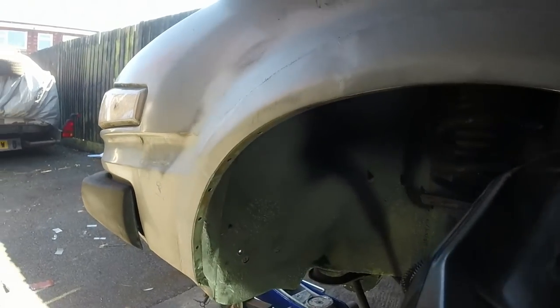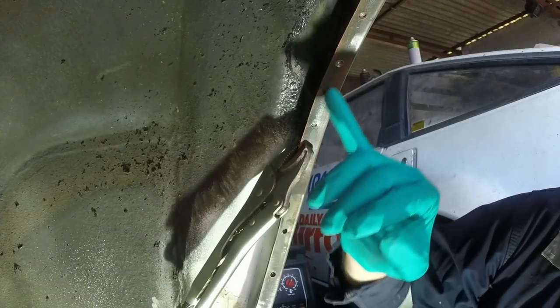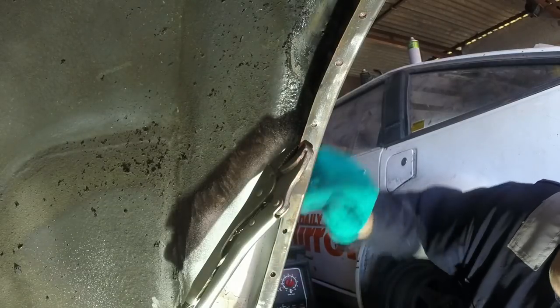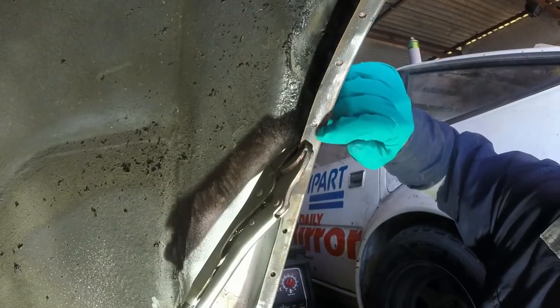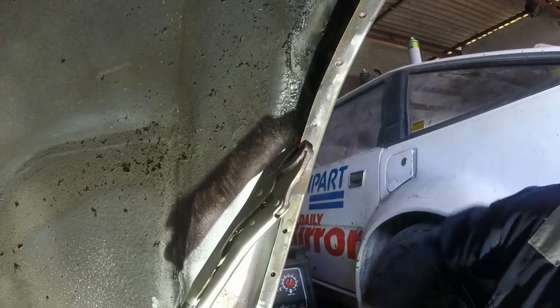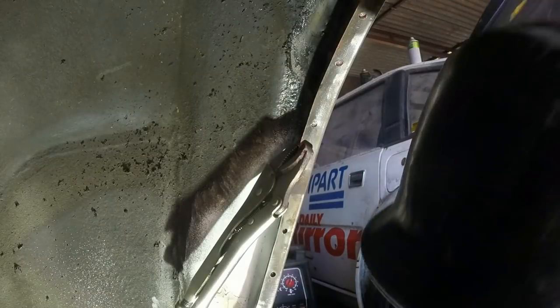Anyway, I'm sure you get the idea. I've just been round with the grips and the drill bit just to close these parts up together again, giving it a light tickle with the wire wheel on the drill just to get rid of some of the rust, and I'm gonna plug weld that one first as a bit of a trial.